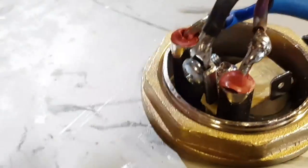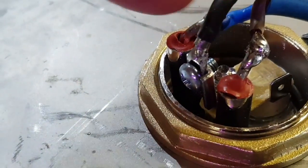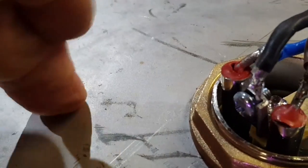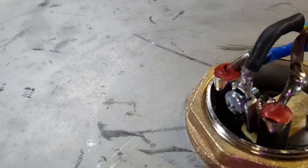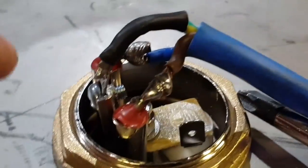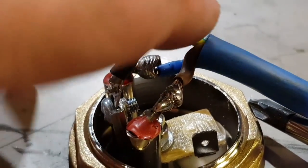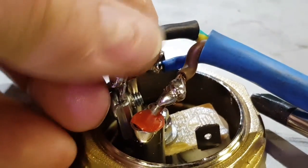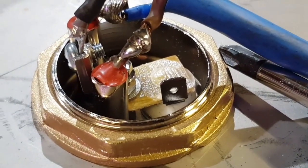All this is going to be on a breaker - it's going to be RCD anyway - all that sort of stuff doesn't matter. If one of the lives comes into contact with metal and you touch the metal, then the electric goes from there, through the metal, through you - and things like the heart stops and stuff like that. But if it notices something coming back from the earth, then it trips and triggers and saves your little old life.